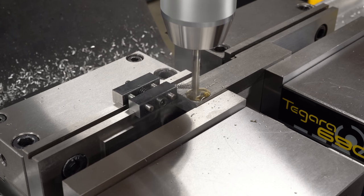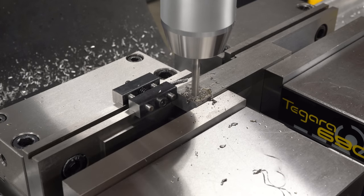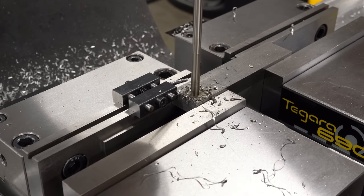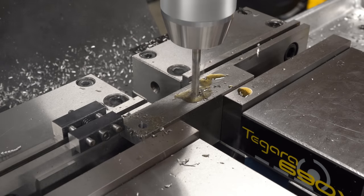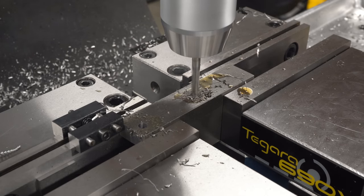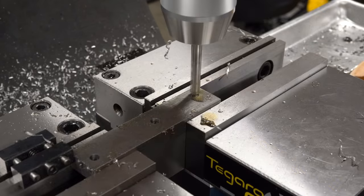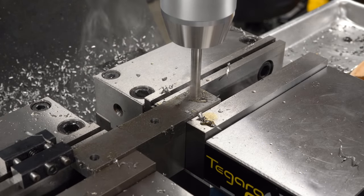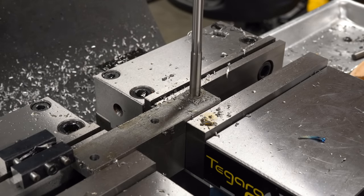The hole at the end is just for the knurl pin - quarter inch. I'm pulsing the feed to break the chip and make sure we don't end up with a razor-sharp helicopter, then coming back with a quarter inch reamer and pushing it gently through in one pass. For the lower arm there's also a quarter inch hole for a pin near the center of the part - same drill, literally - drilled one size under and reamed to final size. The last hole in the upper right corner is a 3/8 inch reamed hole for the hinge pin.